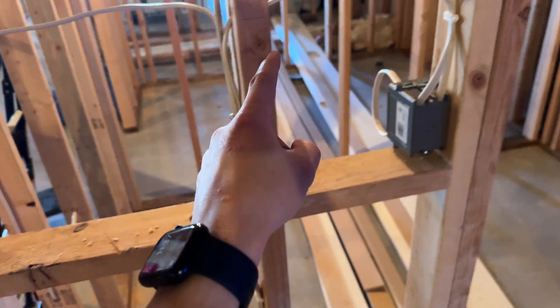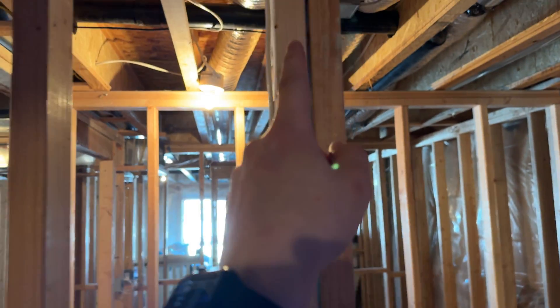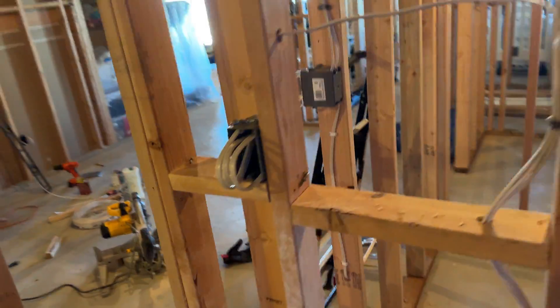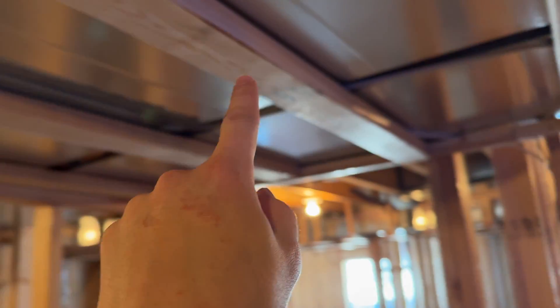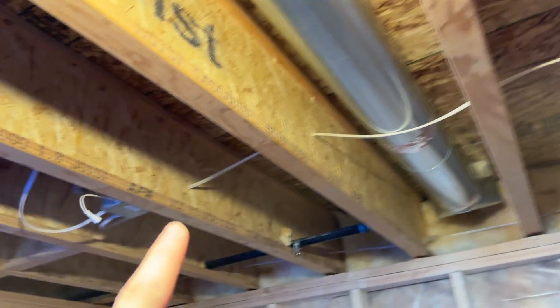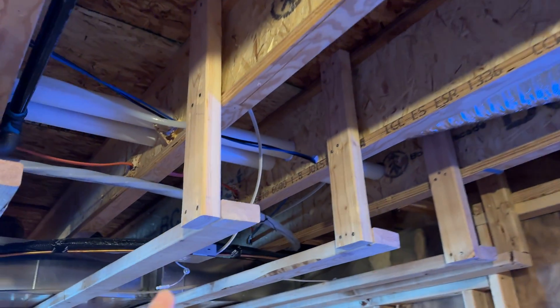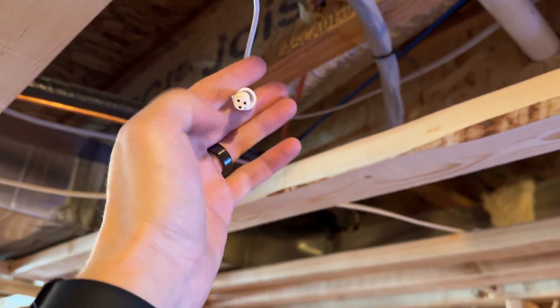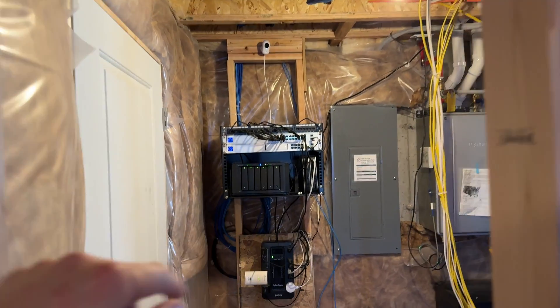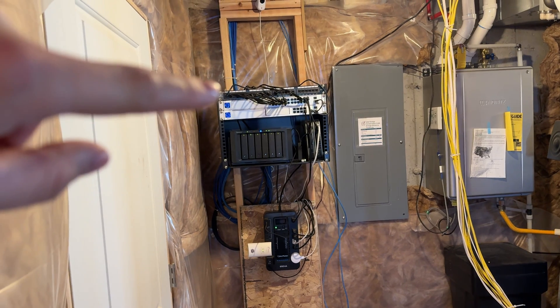It branches and goes back up here into this switch box, which goes up into this light right here that we will eventually put in once the drywall goes in. Similarly, the third one we've got here goes up to our lights, up and under, right here — and these are just daisy-chained just like the outlets. We've got four canless lights going in here; once the drywall's up we'll put the actual lights in and they just plug right into these and hang from the ceiling. Last thing we did was put a couple of low-voltage wires in here, some Ethernet cables in case somebody wanted to plug something in, and we ran those over to our server rack stuff right there — dangling so we can plug them into our patch panel and then from our patch panel to our switch. And there you have it — a fully roughed-in electrical room. If you like what you see, make sure to subscribe. See you next time.